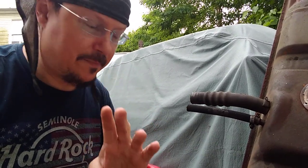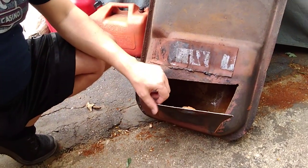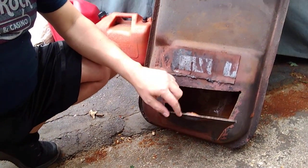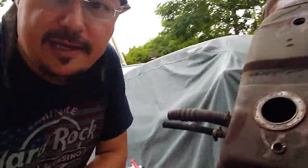Now I'm going to try to do what I saw him doing to see if this will work with this sheet metal, because that metal's really thin, and with the welder, especially the stick one, you'll burn a hole right through that thing. It will just melt right through it. This is going to take a real controlled weld to get this to come out right.